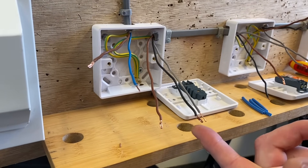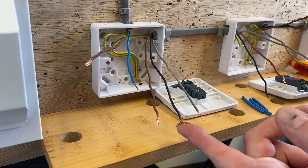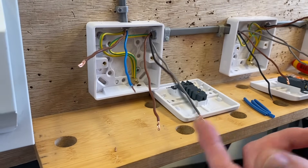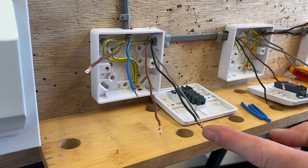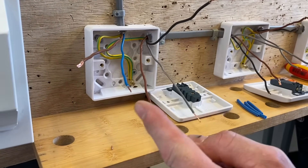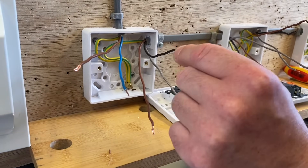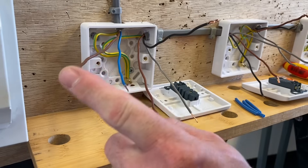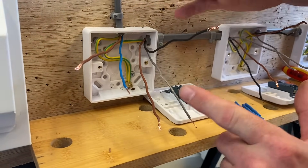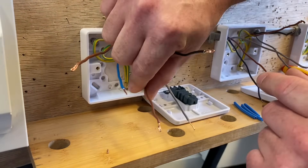When the new cable system came in in 2004, the black conductor became a line conductor - in the old pre-2004 system the black conductor was neutral. The rule is we try to de-neutralise black, so you might think to use black as the neutral because of the old system, but actually the reverse applies: best practice is not to use the black. I'm going to use my grey as my neutral - that's going to carry it forward. So grey becomes my neutral, and the other two become switching lines, with a permanent line also here.